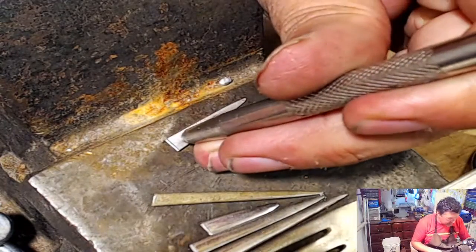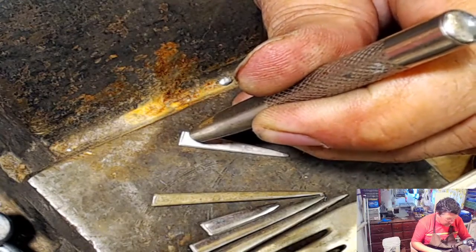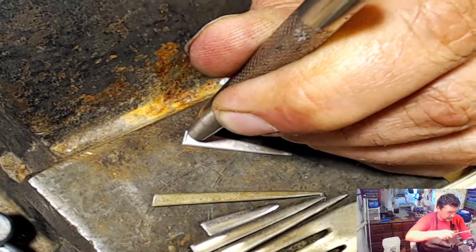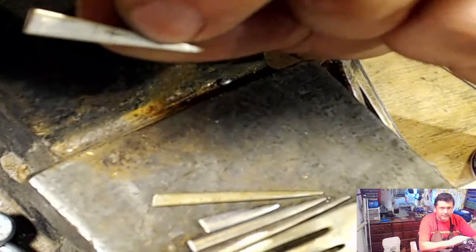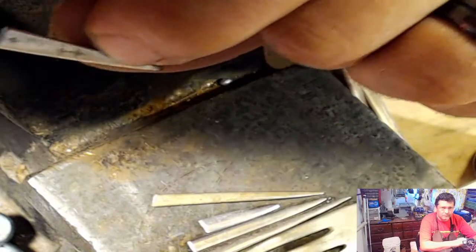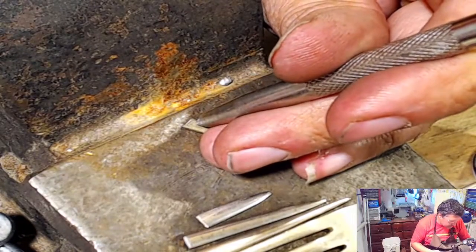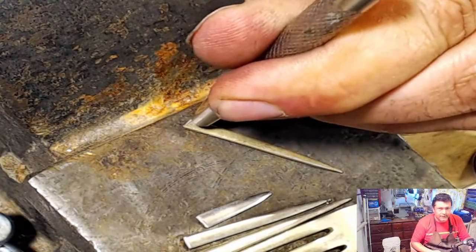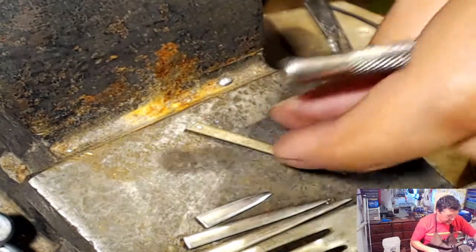Whenever we're doing this we want to make sure that we have enough room here to do our trimming after. I'm just going to put it there and give it a nice smack - you generally get one chance with these. The other important part is you want to make sure that you're going straight up and down. You don't want to be coming at an angle because your drill bit is going to follow that angle.